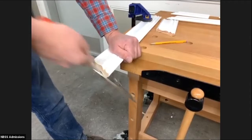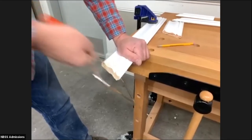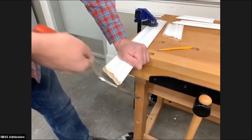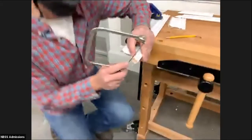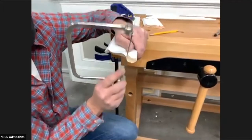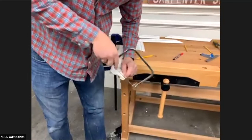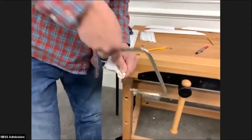Staying relaxed, back cutting it. Now that's one and two — I have a third cut here. I want to stay right off my line. Now I'm going to cut straight across here — that's a little trick. You have to think about that corner coming out, because that corner is going to meet the other molding.